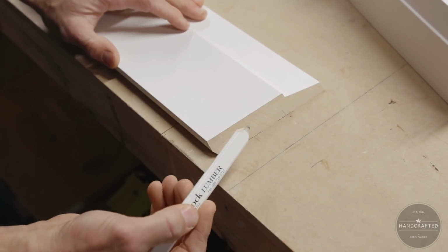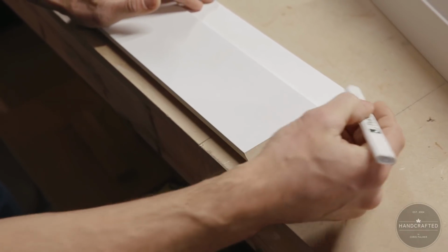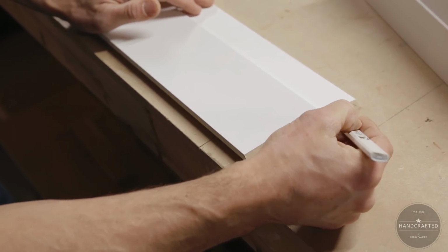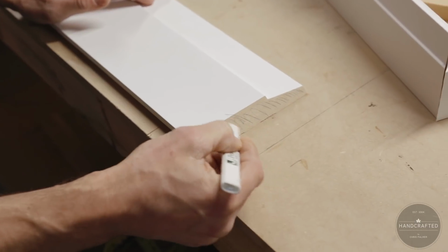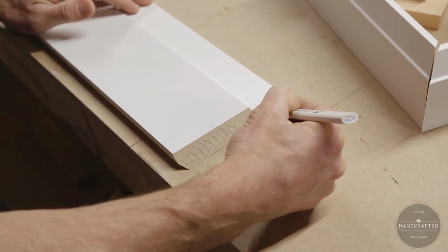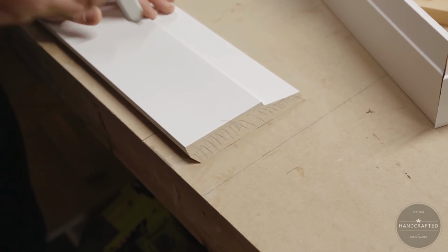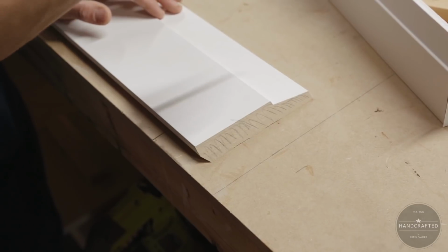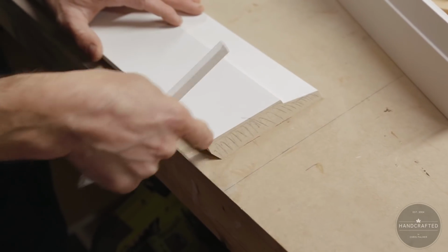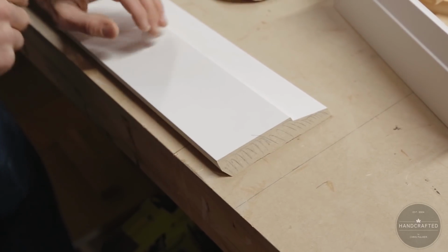See this cut? This is an inside corner. This is if we were doing an inside joint on baseboard. But what it actually is, is the perfect reveal to allow you to see the profile that you need to take the coping saw to. I'm going to run my saw right along this edge, and along here, cutting vertically. As I do that, it's going to cut away all this excess material so that my piece will butt into the next one like a perfect puzzle.